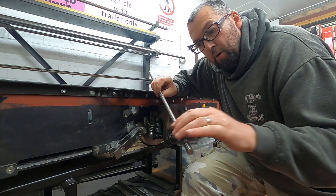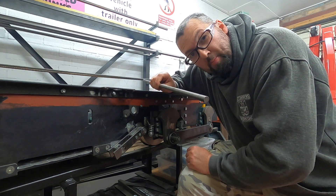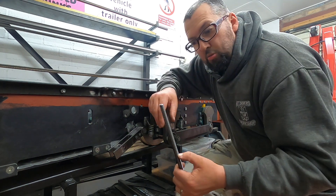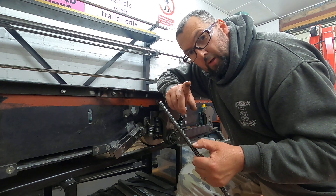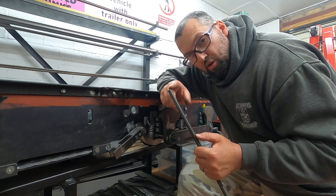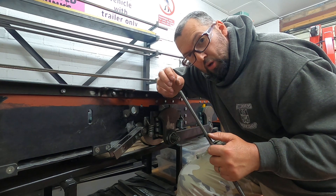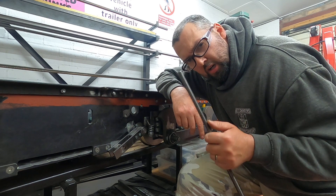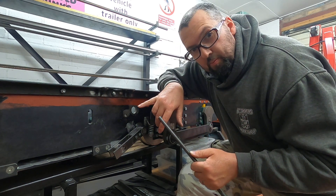We're going to use this threaded bar, but I don't want to use all of it because it's quite expensive and I could probably make more than one brake shaft out of it. We'll use about 6 inches and then attach it to a piece of 12mm — this is EN8 and the 12mm is stainless. The two really don't mix, so we're going to machine the end of this down so it goes inside the 12mm and then silver solder the two together, which should be very strong and shouldn't snap.